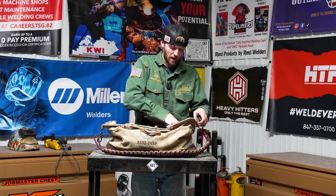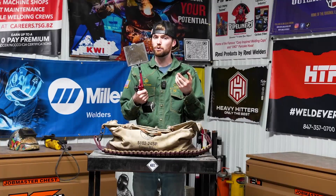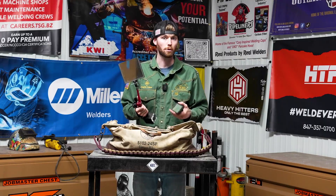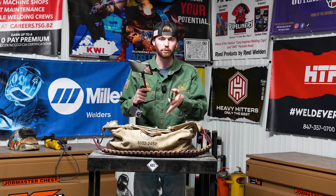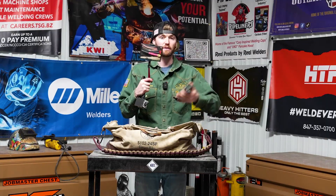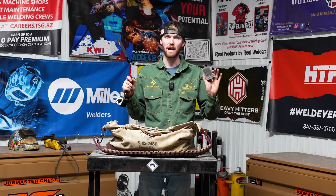Next is going to be a mirror. This mirror is from TechnicalTools.com. I have a bigger mirror — like a 4x4 — and a smaller one, about 2x1.25. If you are a welder in today's industry and you want to be able to make any weld out there, you've got to have two skills: the ability to mirror weld, and the ability to look through the bevel to put a root in. If you have a mirror and that skill set, you can make any weld. I keep these mirrors in my job box with foam, and if I have to carry them into the rack, I'll put foam around the glass and tape it up.